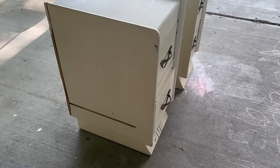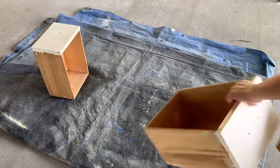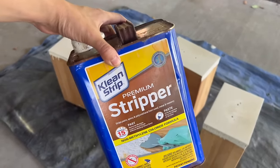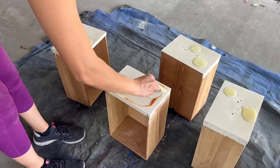They were in okay shape aside from a paint job I was not content with. So after removing the drawers, I took out my 15-minute paint stripper and spread that out evenly on the drawer fronts in a very thick layer using a chip brush.